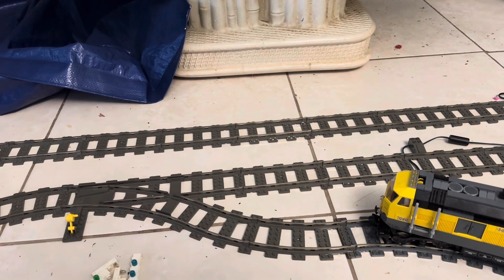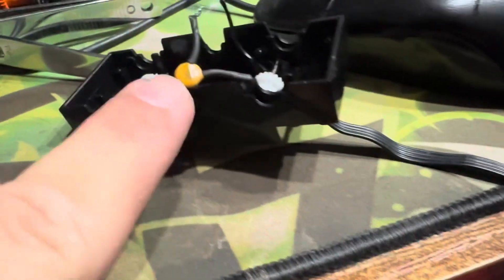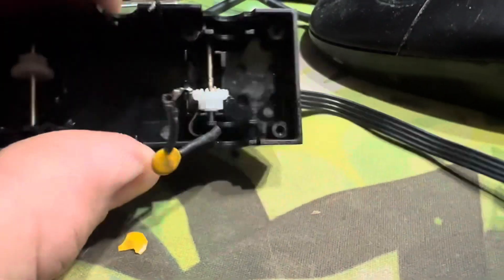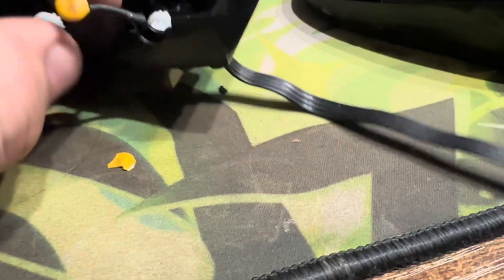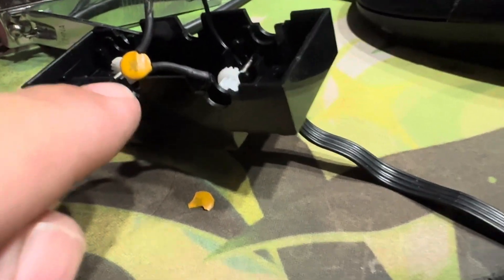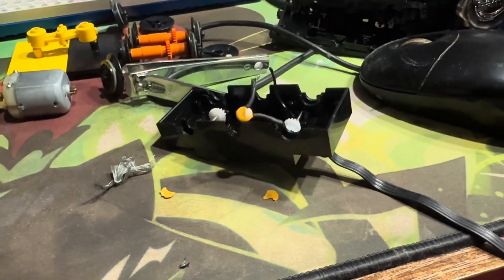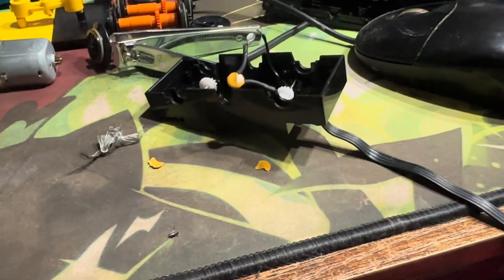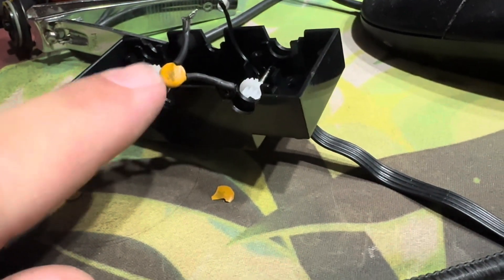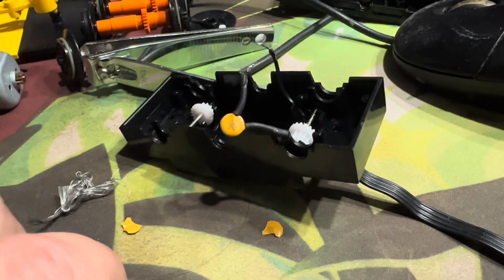I'm making another video to show you what I replaced. You can see the coating — that's the exact same or very similar thermal overload component. It goes down here on the 9-volt motor and it's just bare underneath. If you get the motor wires off and peel this coating off — which is a little hard to do but not terrible — that's a new thermal overload. That's the only thing I had to replace. I might look into finding these without the coating, because I'm sure I'm going to have this issue more and more with these motors. So that's another component that seems to fail, between the motors getting gunked up and the thermal overload. Thanks for watching.